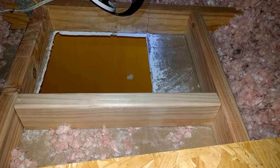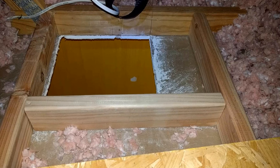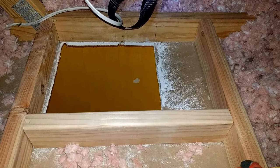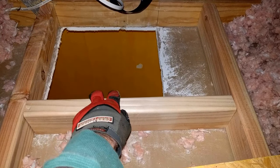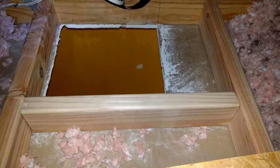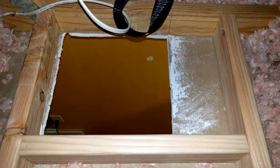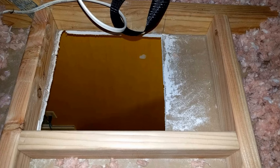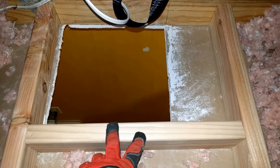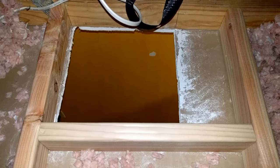After much toil, near misses, and awkward stretches, I got the header built. My ceiling joists are about 22 and a half inches apart, and according to the installation manual, the cross piece was to be 17 and 7/8 inches long. I've got all of these screwed in — it feels nice and sturdy. I'm not exactly a carpenter, but I think it'll be good enough. It's fairly square and the measurements seem to work. The next step is actually screwing the body of the fan up through the bathroom ceiling — it will screw in on this side, this side, and that side over there.